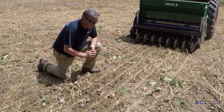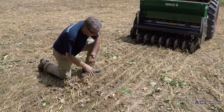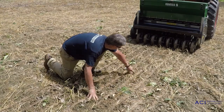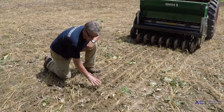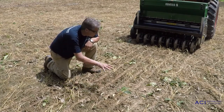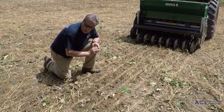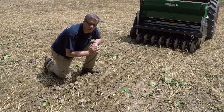We've made our first calibration pass — set the machine for depth and pulled forward about six or seven feet. Checking for seed: I can see soybean seed here, millet, and more seed in multiple spots. Obviously this is good soil with good moisture, but clearly our depth setting is not enough. If I saw one bean here and there I wouldn't be too concerned, but I'm seeing a lot of beans. So we're going to lift the machine up, bring our pins back to the one inch setting, drive forward again, and see how much seed is on the ground.